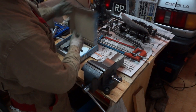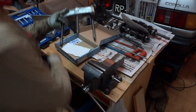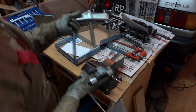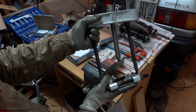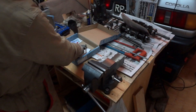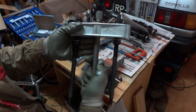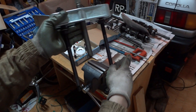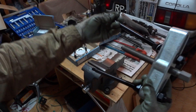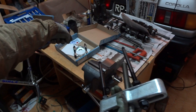Now the top of the bearing puller looks something like this. It goes into the base like so. Then this middle bolt here goes up and down. It is fixed to the shaft in the gearbox like this, and then we actually screw this in to pull the bearing in this direction, with that piece placed at the bottom.